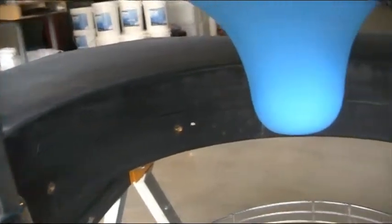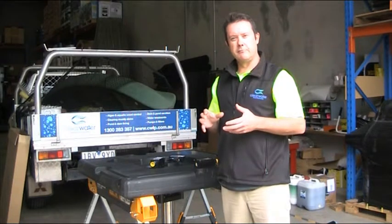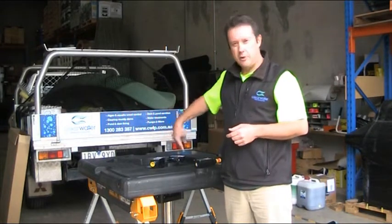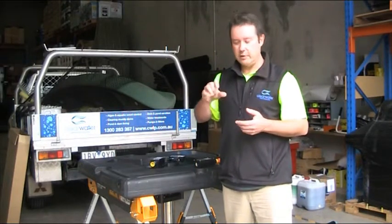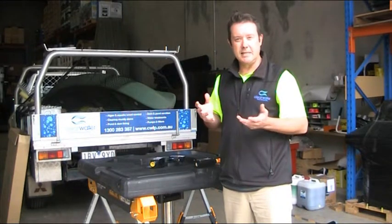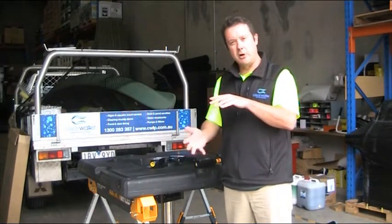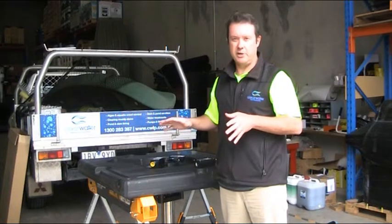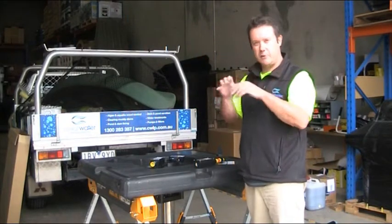The float also has anchor nuts around the inside of the circular cutout, which enables you to add an aftermarket screen filter if you're in a situation with lots of rubbish, debris, or shopping bags that could cause damage. You can simply roll either a piece of stainless mesh or plastic — say an inch-by-inch gardening type plastic — into a cylinder around the inside, dropping it down about 500mm deep with no bottom so that water can still draw in. Having said that, it's pretty extreme when you need to do that — in most cases the unit's normal spray operation pushes the debris away.